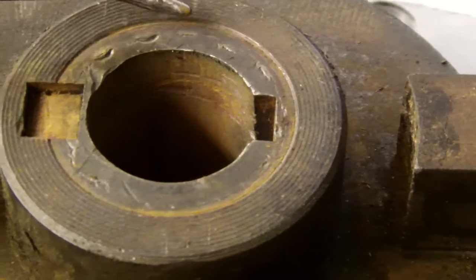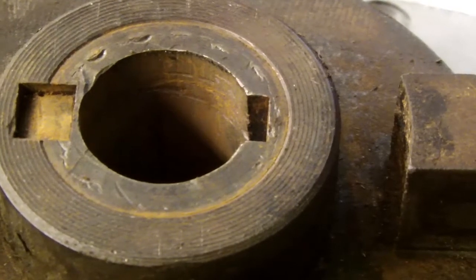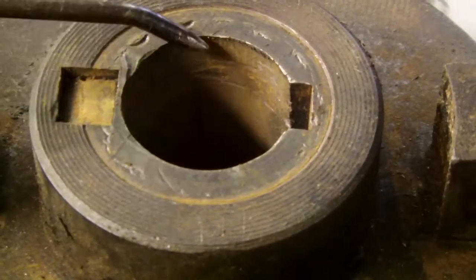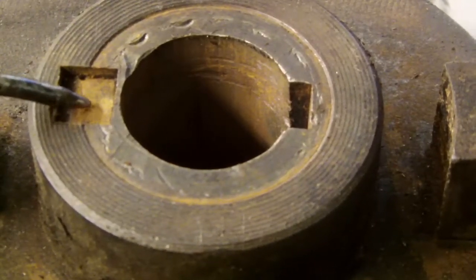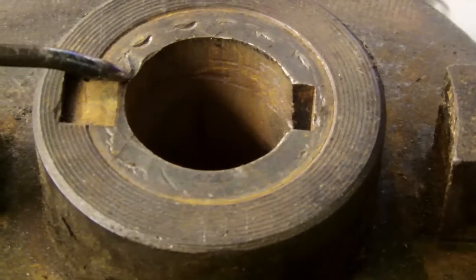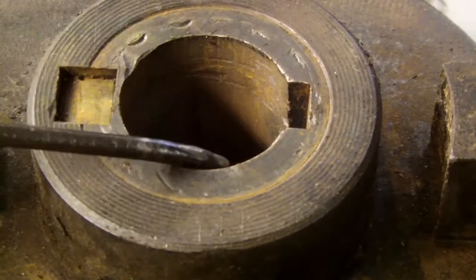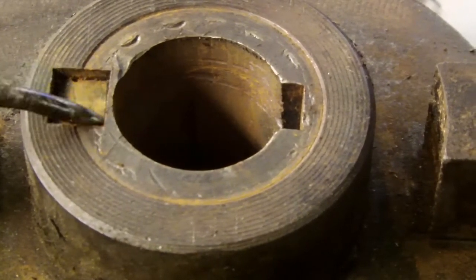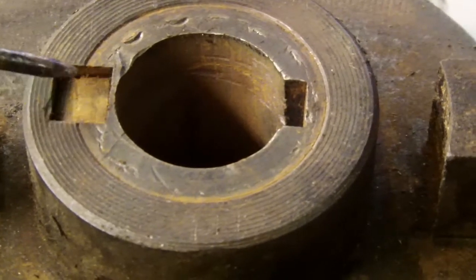Because the new motor shaft has a diameter of 28 millimetres, that poses quite a few problems. I can't use this shim again because this bore is 24mm. Secondly, this original key does actually only leave about a millimetre of steel left, and as the 28 millimetre diameter would need the thickness of these walls to decrease by two millimetres, the motor shaft would actually interfere with the key. So that's not a great deal of fun.